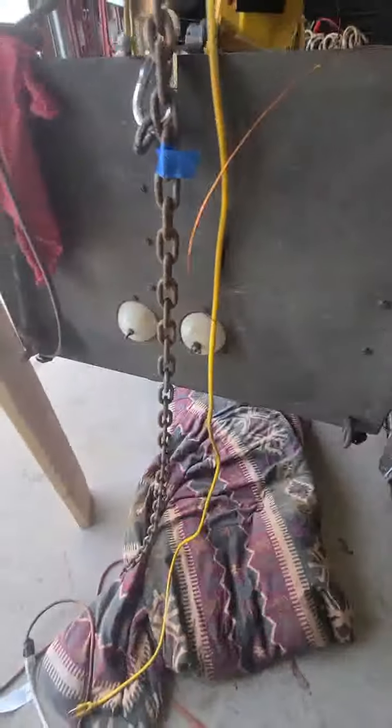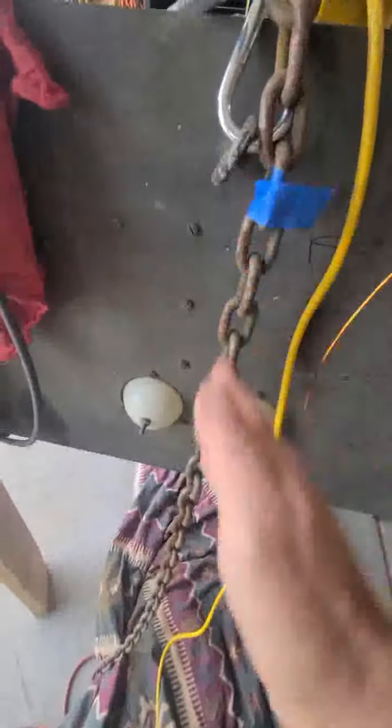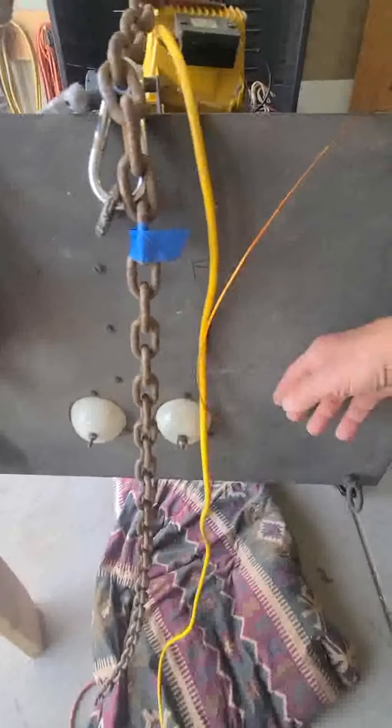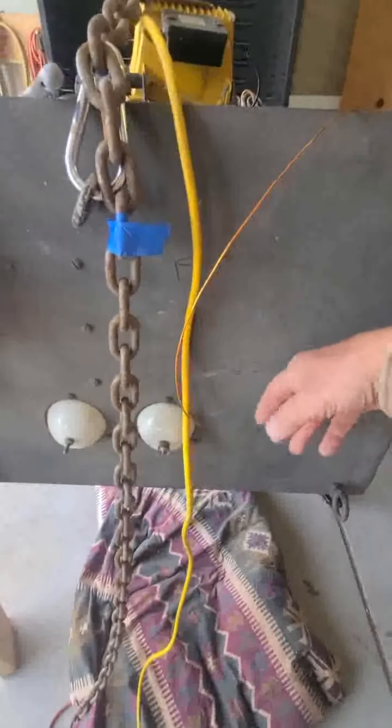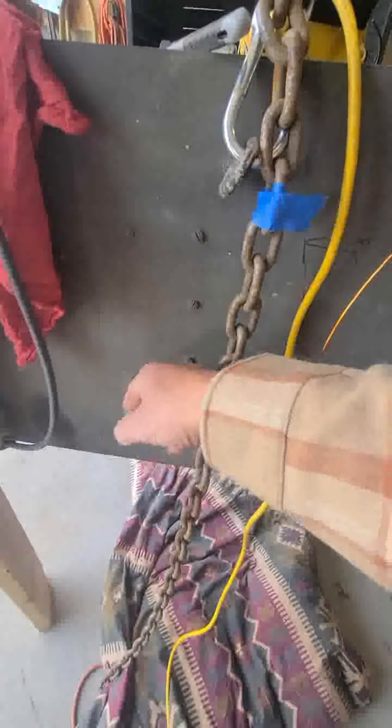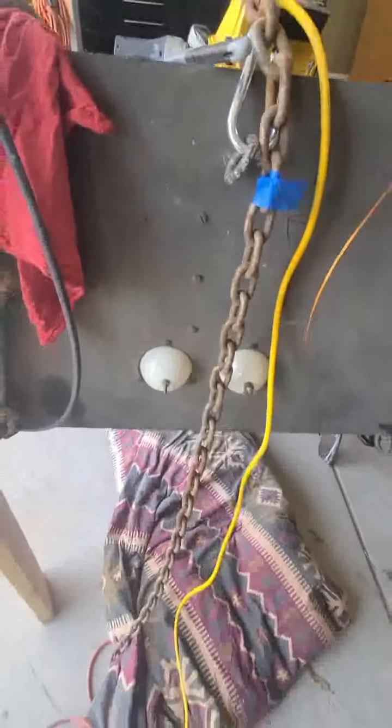These are the two antenna leads. It's got two transmitters in one. It's got the low frequency transmitter that covers 300 kc to 1600. Then it's got the high frequency transmitter, antenna goes on this side, which covers 1600 to 18 megs.